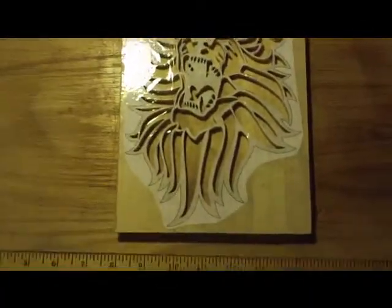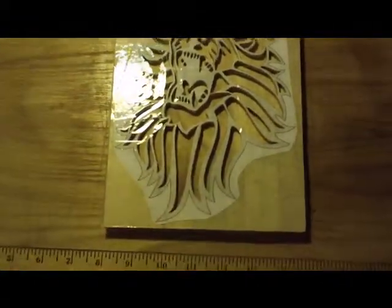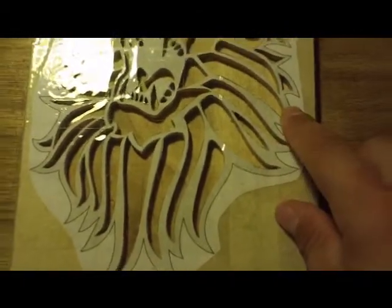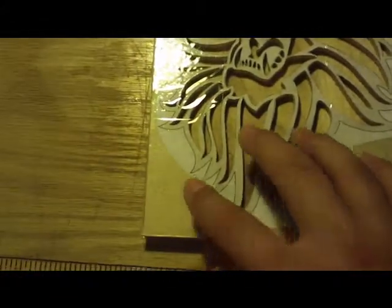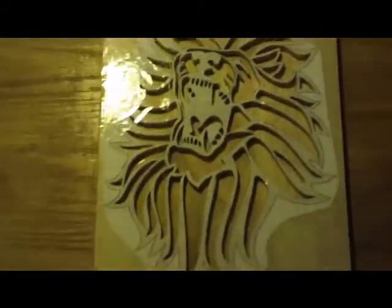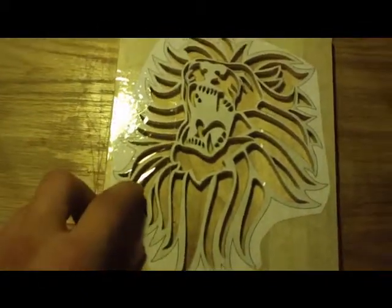Okay, I'll show you what I've done. I just put on a lot of tape going both directions, so I felt there's no need to put on the nails. I drilled a hole to cut out the inside first, because if I enter from the end of the board, this would all break away when I'm cutting around here, and it won't stay together. So cutting the inside first will be easier than starting from the outside in.